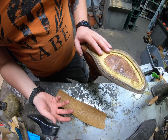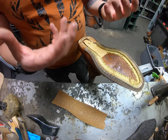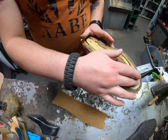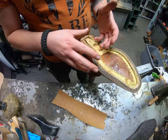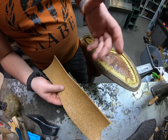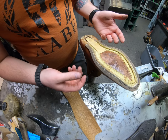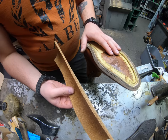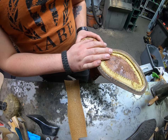Now we're going to go ahead and lay this cork. We don't use hot cork - cobbler shops don't get what's called the hot cork machine. The hot cork machine basically squeezes melted cork from a block, melts it down to goo, and fills in the crevice. You have to have something fill it in, otherwise you will feel that ridge significantly - cork is perfect for that. At the factories they use the hot cork method because they're mass producing; for cobbler shops it's not worth having that machinery. We get these pre-cut sheets instead and end up gluing them in.